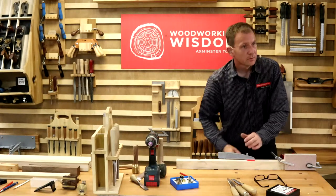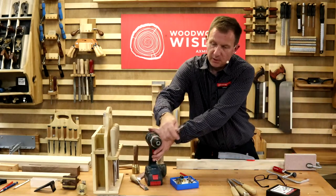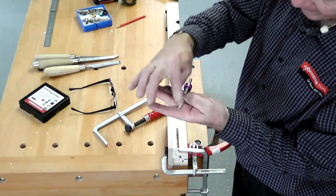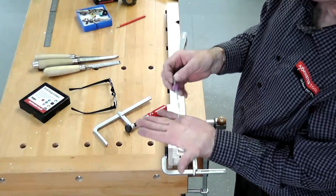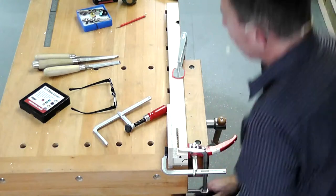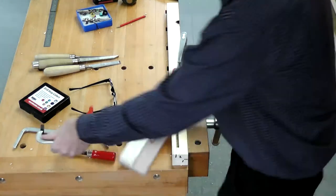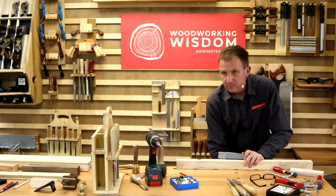David has asked — is the drill bit a Brad Point drill bit? It is. It makes it easier and it also comes out with a flat bottom. You have a lip and spur, Brad Point — similar sort of things. Tends to be more flat-bottomed than what I would call a standard metal drill that comes up to a point of about 60 degrees. A Brad Point also makes it easier to locate it in this groove and less likely to wander out. The drill I've got in there is a 7mm drill and I've got an 8mm chisel — so it's slightly under the width of your mortise. The chisel is going to clean that up. You don't want it being the same size — if you wander with your hole, you're going to make it wider.